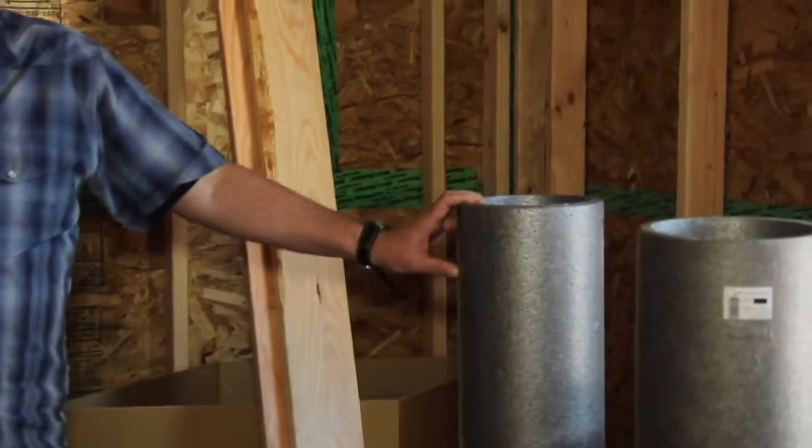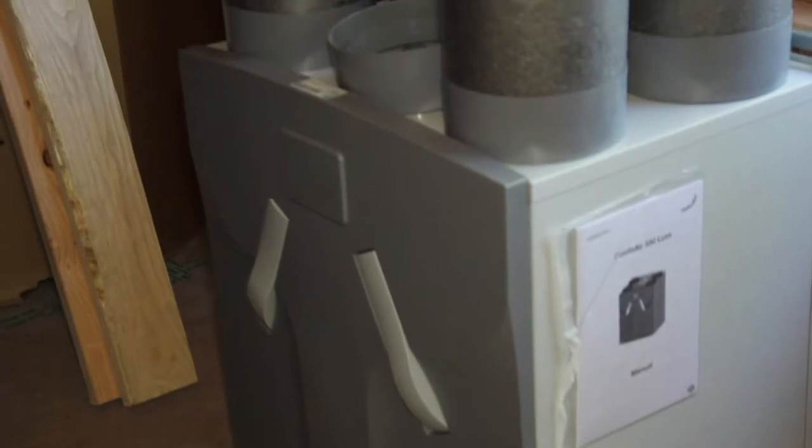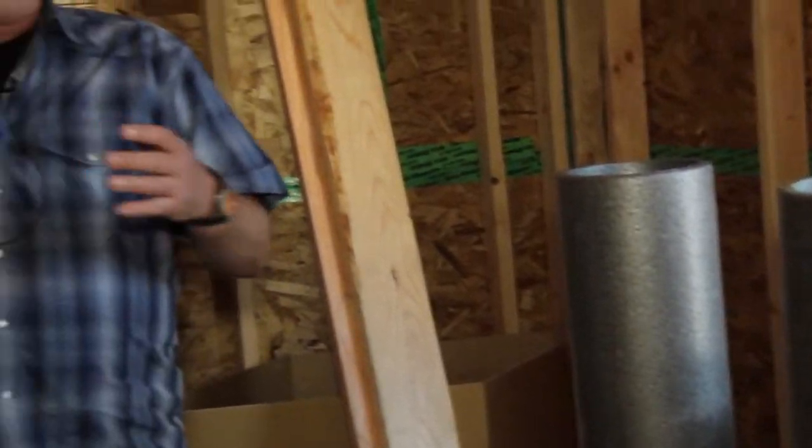One of the principles in passive house is that we have an airtight structure to help with energy efficiency. When you take a space planned for 10 people, make it airtight, and then put 80 people in it, you could have some indoor air quality issues. We handle that in passive house using a heat recovery ventilation unit — this is a Zehnder unit from Germany. It has a carbon dioxide sensor so that automatically, when CO2 levels rise, it ramps up in a variable speed fashion.